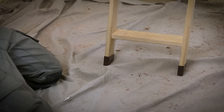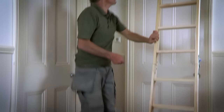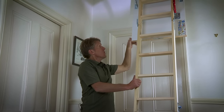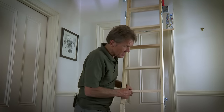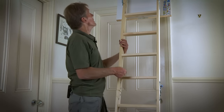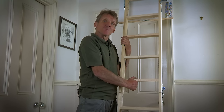From the installation point of view, I'm just going to do the trim around the top, put the architrave around, fill in any gaps, and it's ready to go. From the customer's point of view, they've got an insulated, draft-proofed hatch with a U-value of 1.1 — which is not bad going at all. Also, these treads are dovetailed in with good old-fashioned dovetails and they're slip-resistant too. This is a ladder that's going to delight the customer and give them years of trouble-free service — and I reckon once their friends hear about it, I'll be fitting a few more of these.